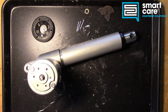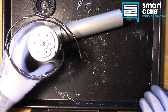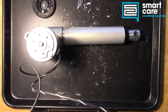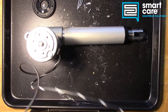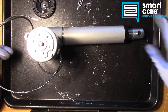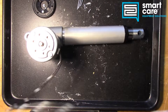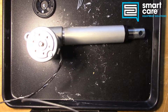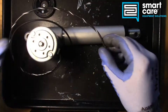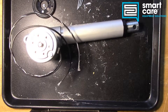We've got the wires cut and stripped. Let's see what happens. See how it's spinning? The end of this is not supposed to spin when it's installed — it would be retained. But you can see the motor was driving the shaft outward as it turned; the gear drive down here was extending the shaft out. Let's try going the other way with it — and there you can see it draw back in. We're only energizing it with 12 volt DC, but it moved at a pretty good rate. So at 24 volt, this thing would have a pretty good speed on the actuator.